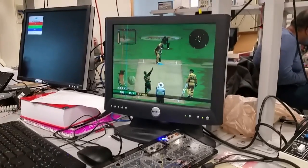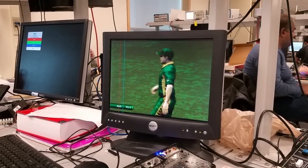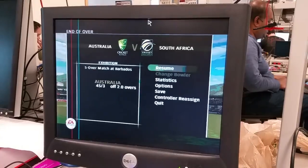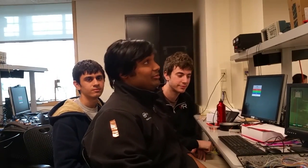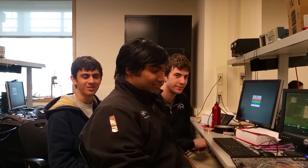In order to reduce our compile times and do quicker development, we decided not to use an ARM or a soft processor on the FPGA, and instead just have an off-chip microcontroller. This way, we can do incremental development with 2.5-minute compilations in the worst case, so that we can keep testing fairly quickly. It's only a couple hundred logic elements. And besides, you were out of I/O pins on the FPGA, all 72 of them. So you had to use an external microcontroller.